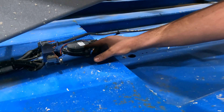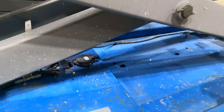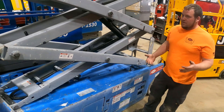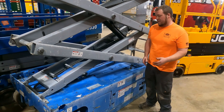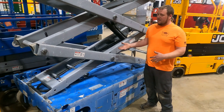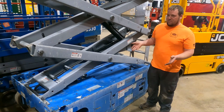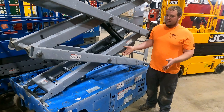So this is what we call a solid state level sensor. If you're looking at an older machine, you might have a level sensor that has a bubble in the middle of it. The bubble ones are of course prone to someone being able to tamper with them and use the machine on an uneven surface. The solid state ones, you can't do that — they're set digitally with a computer. You have to zero them, and there's no way for a customer to mess with it other than unbolting it, and they're a little too sensitive for you to do that.